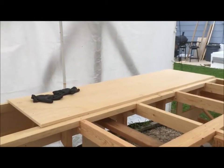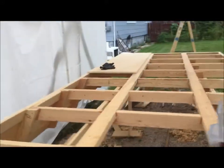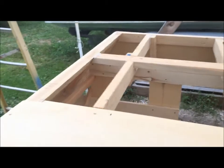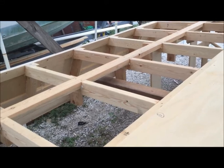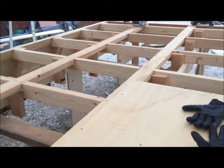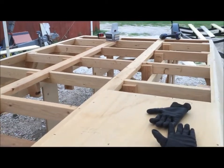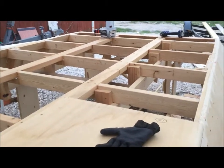What we are going to do now: I've got this piece sitting back in place with the hash marks lined up. I'm going to trace a line down the side and right across the front so I know where to put the thickened epoxy — and not get it in places where I don't need it or miss places I do. Then I'm going to go downstairs and mix up another batch, come out and smear it on, and screw this piece down.